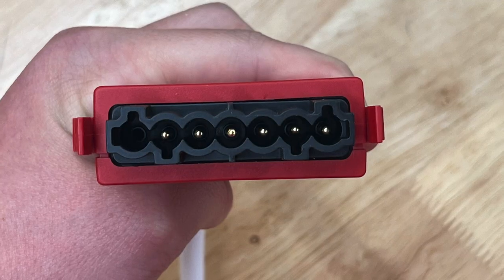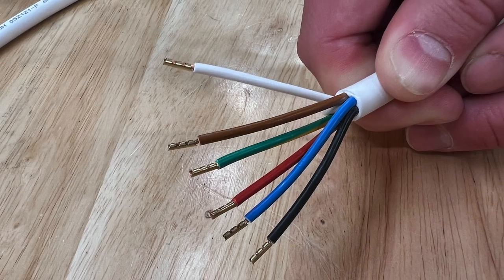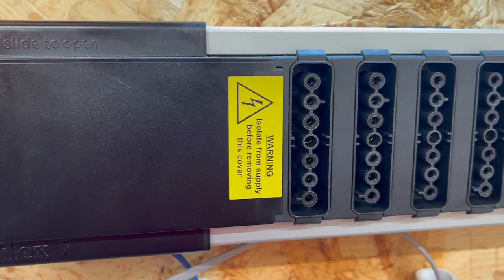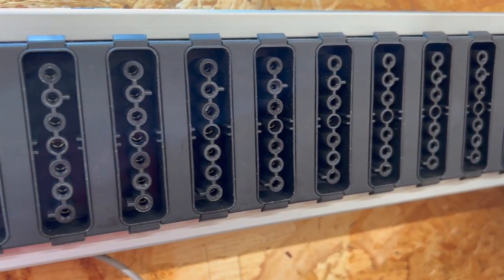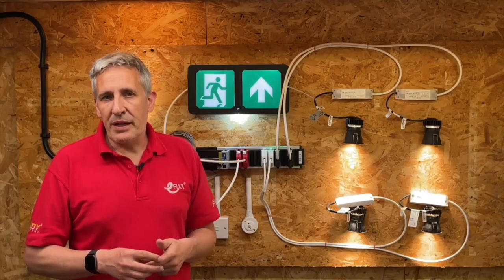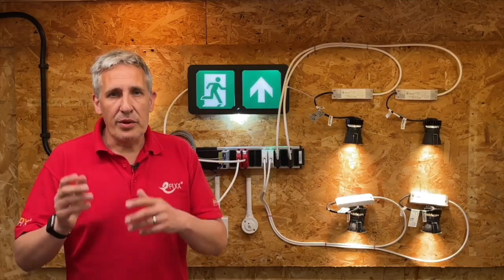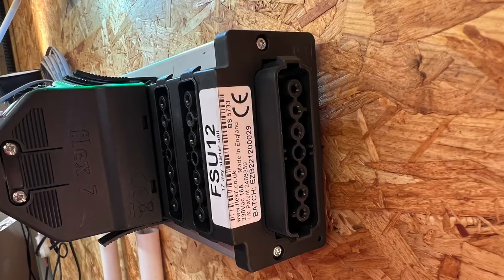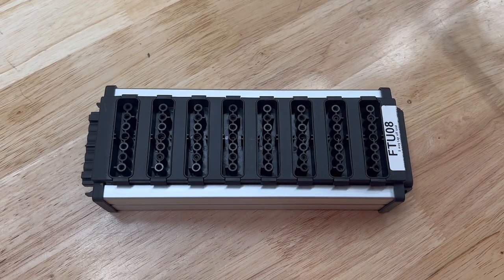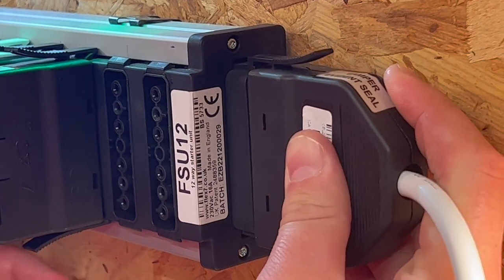For outgoing lights, a switched lighting fixture will just require a three-core lead, and at the other end of the scale, a fixture with DALI control plus emergency lighting may require six poles. The fixed building wiring connects to the Flex 7 system with a starter box, like the one here, which can be mounted directly to the fabric of the building, fixed to a cable tray, trunking, or suspended rods. The number of outgoing ways can be configured from two to twelve, and there is a spare socket on the end which allows for future extensions using either an expansion box or an expansion cable.